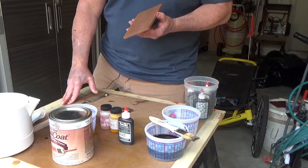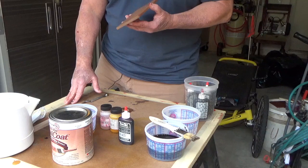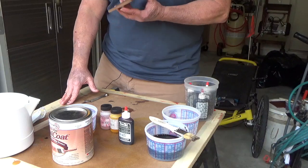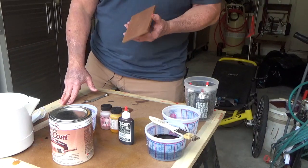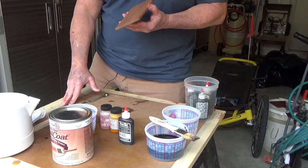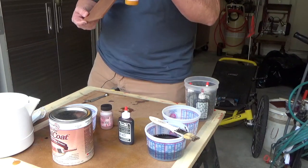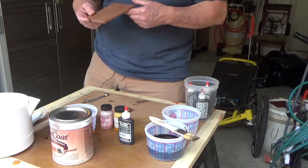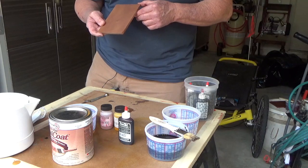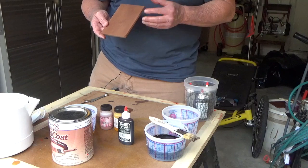So if you try to put a second coat of stain color the next day because you don't think it's quite dark enough, you go to wipe off the excess and almost all the color comes off — because that binder portion of the stain solution is preventing more stain from being absorbed into the surface. Not the case with dye colors. There is no binder. You have the dye powder — that TransFast powder dissolved into the carrier, the water. Once the water evaporates, we could put a second application of this dye if we chose to. We're going to move on to our first coat of clear finish, which is going to be our shellac.